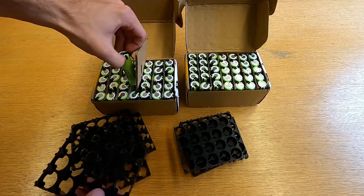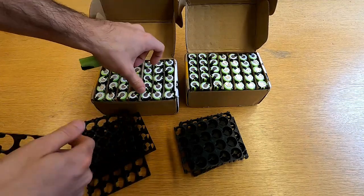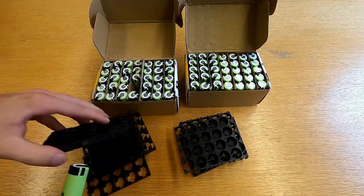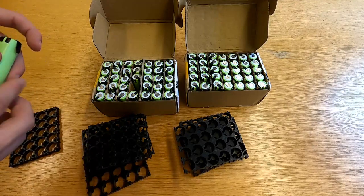Now in the optimal case you would build the battery with a battery welder. Use thin nickel strip and two contacts to permanently weld the nickel to the batteries. This is good for them because they don't get long heat exposure that you would get with a soldering iron.